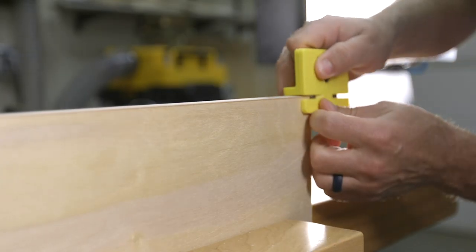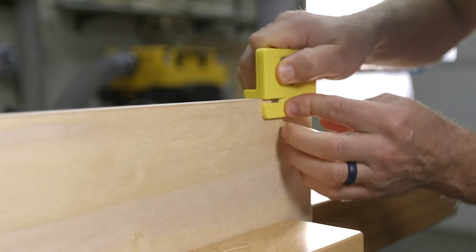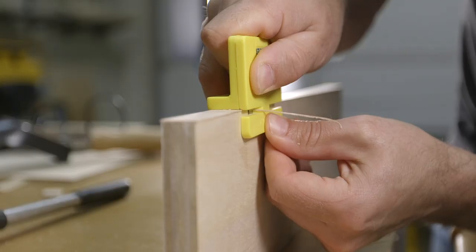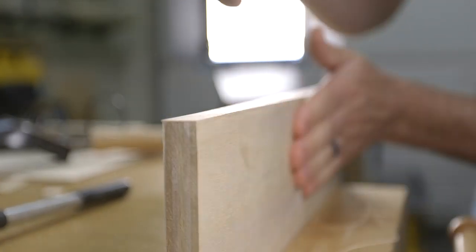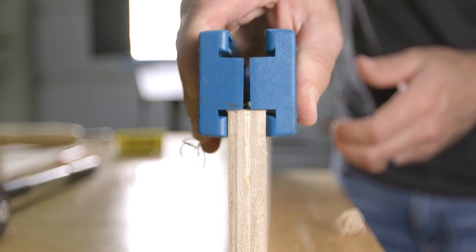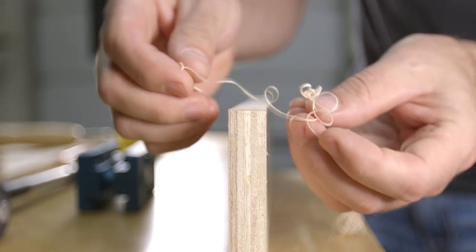With that done, it's time to trim the long edges. Each trimmer works a little differently. The banded trimmer only trims one side at a time and it's a little fussy — it requires some adjustments moving it up or down to get the blade to engage. Once it's cutting it cuts pretty close, but not as good as the dual-sided style, which cuts from both sides so you can squeeze the cutter tightly to the plywood producing a closer cut. I do recommend buying this style instead of the banded style, but if money is a concern you can totally make the single-sided one work.